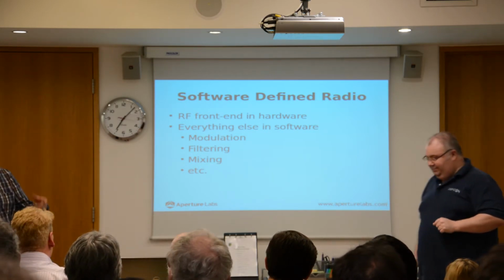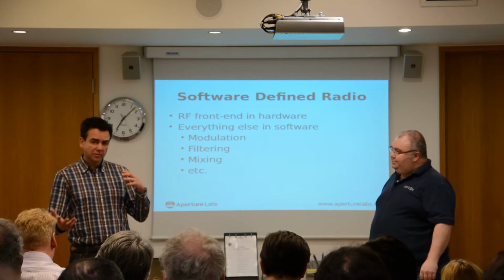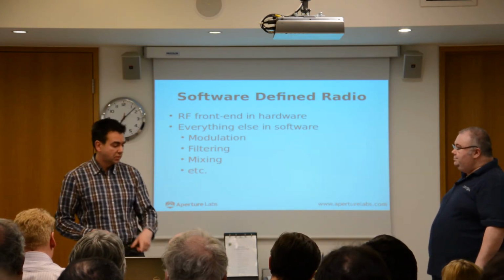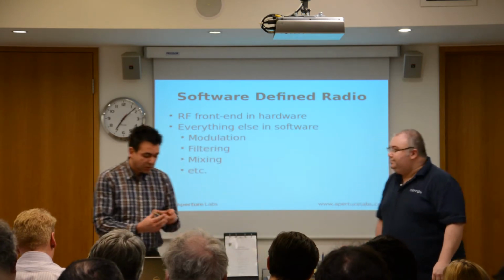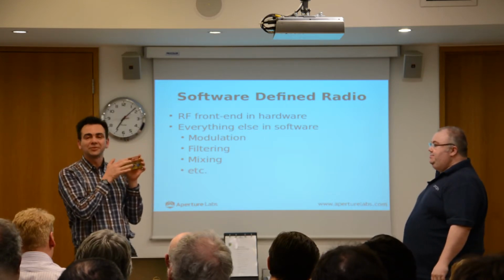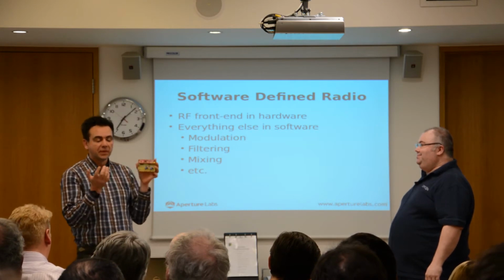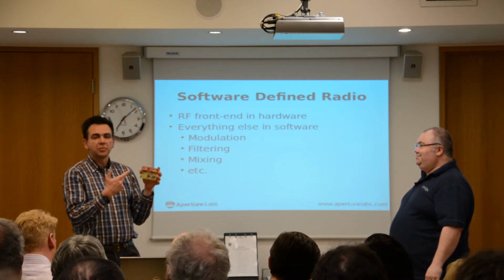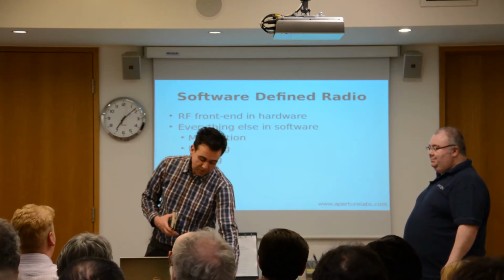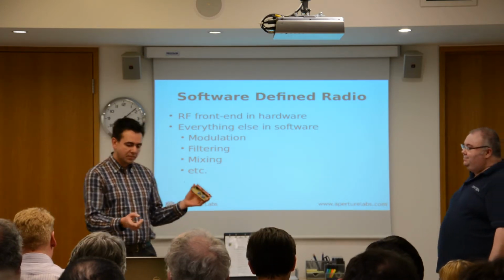Okay, so yeah, the whole premise of this was that with all these different designs and different standards, there are circuits being designed to cope with each different standard. I've actually got some more detailed slides after your next pictures, but the whole idea was we have the nasty, scary analog circuit down here, which is the bit he's good at, and then we have the lovely, shiny digital circuit up here, which is the bit I'm good at, and we get them to talk to each other. So all I get is the digital output that we can then process and decide in software. So we ignore whatever the standard is. All these different tags have different standards, but I'll talk in a minute about why fundamentally they're all talking the same language, even though they're very different.